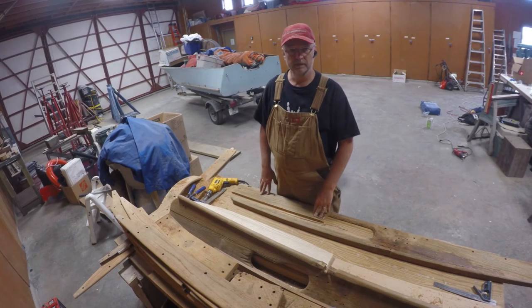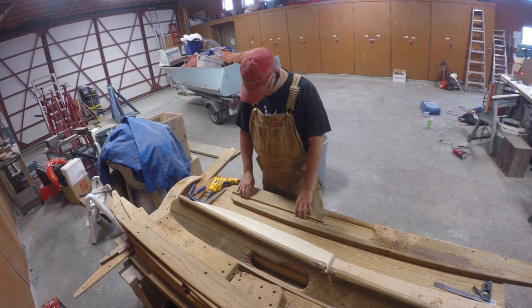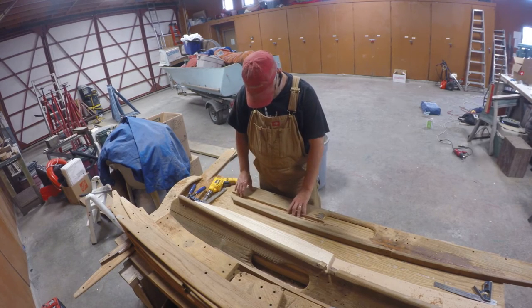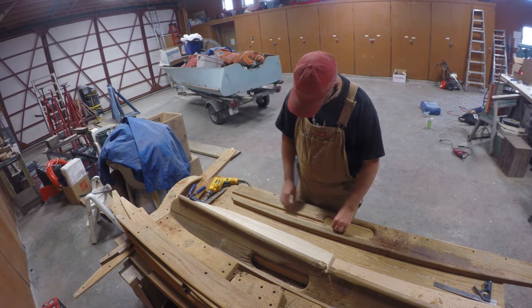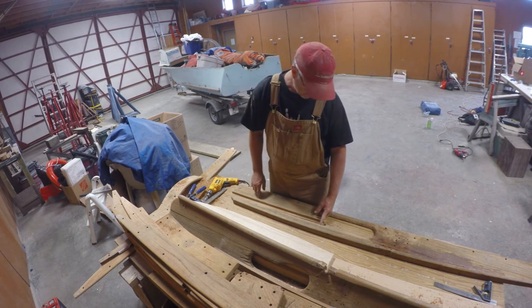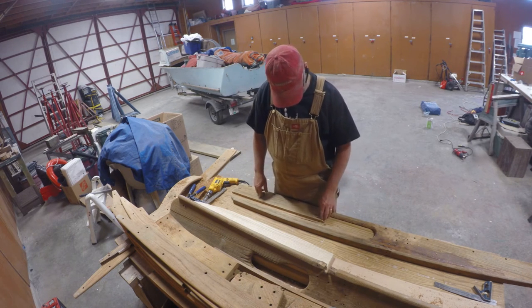So with a bit of fussing and clamping and measuring and remeasuring, I managed to router out the damaged portion of teak. It's not perfect. It's still split at the bottom, but I'm going to lay a little bit of glass mat in there to cover up the divots and holes and what have you, tie it together. And I'm going to cut a donor piece to fit in there. It will not fill entirely because I'm going to cut the donor piece square where this is round.